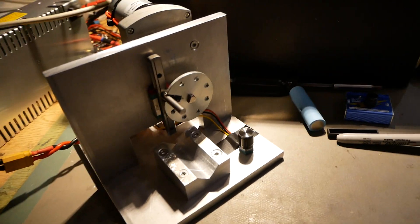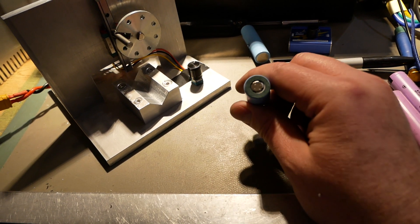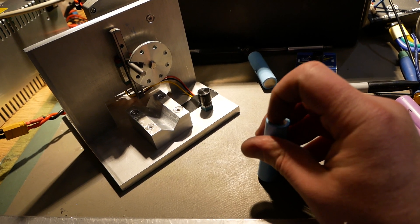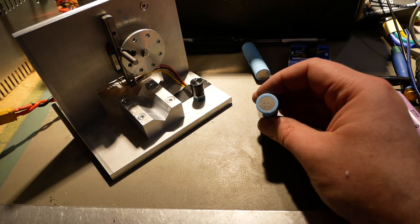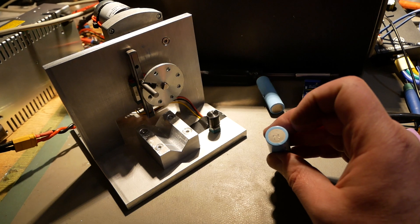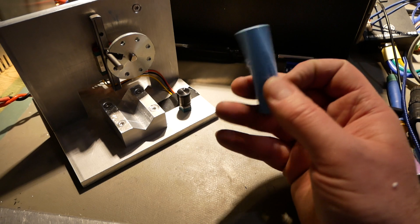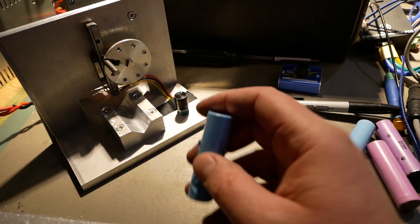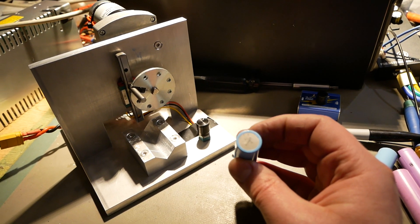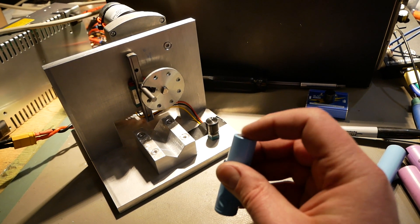Let me show you a cell or two. This one here — you can see the nubbins on the bottom of it, and on the top as well. The top and the bottom of the cell are quite rough to the touch because those welds stick up. Those were trimmed off with really close flush cutters, and that's as good as I can get them that way. I've used lots of recovered cells this way and it's okay, but now I have this, which is way better. This is an LG MH1 that I ran through here, and wow — this is a huge improvement. To touch, that is completely smooth: no bumps, no depressions, nothing. You can see where the metal is discolored from where the four weld spots are, but it's otherwise perfectly flat, like a brand new cell.